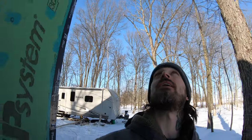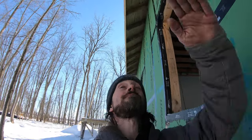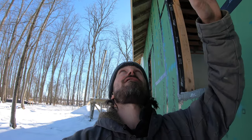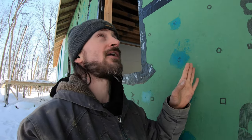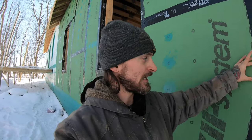We've got to get those air channels in so they can all be spray foamed together, locked in and airtight. And then of course, up underneath here, we've got to go ahead and build out a soffit. So we'll get some 2x4s that will be parallel going straight in to here, and we can toe nail those in there, or run a 2x4 that will be connected to the house this